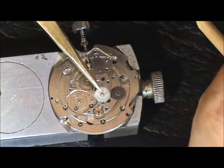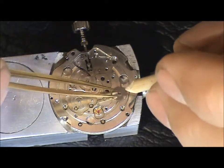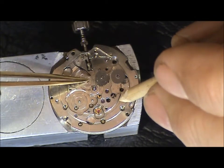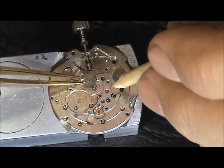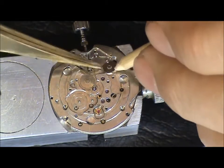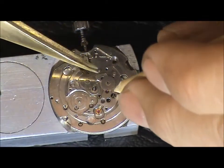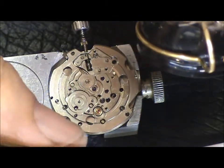here's the standard. Good example. See, here's the standard minute wheel, right? See how it's got the hole down the guts? Whereas this one hasn't. If you look on the back, it's got this little post which goes in the hole. See, it's back to front, you see? And he goes in like that. That's because normally the minute wheel turns the hour wheel, whereas this has got this little extra cog on top, and it's got to turn the world timer. So that's a bit of surplus.